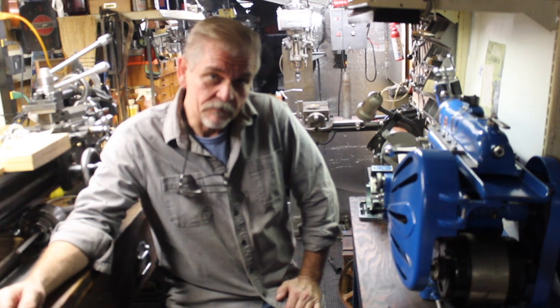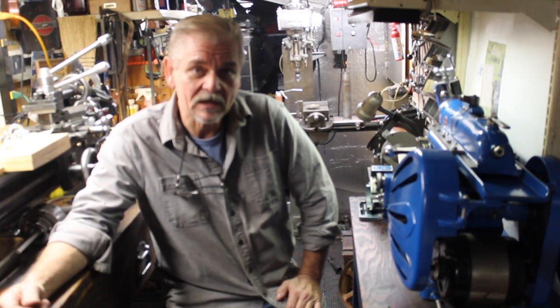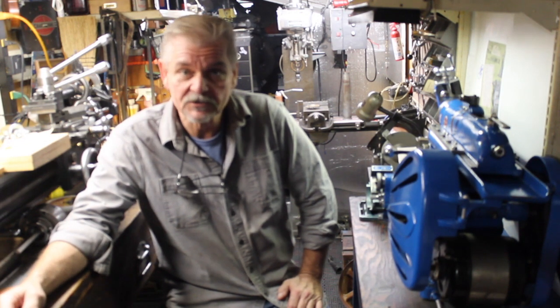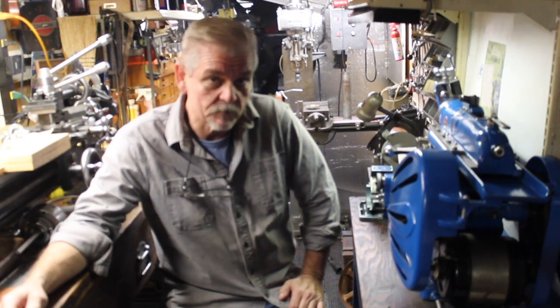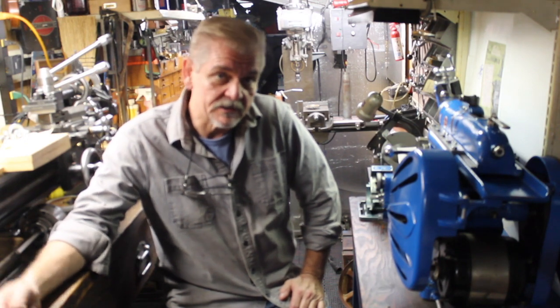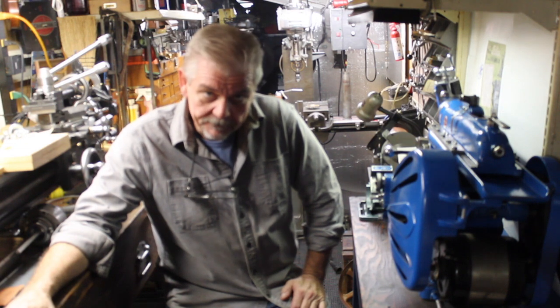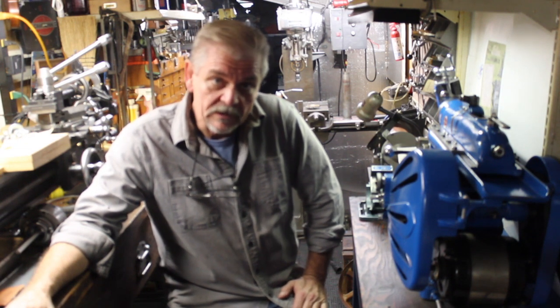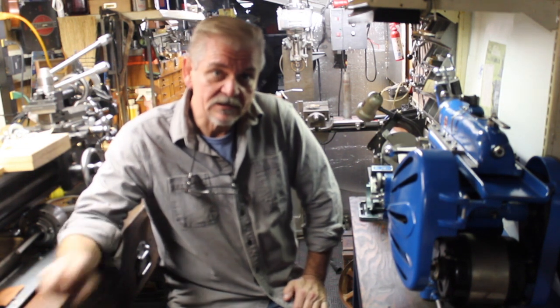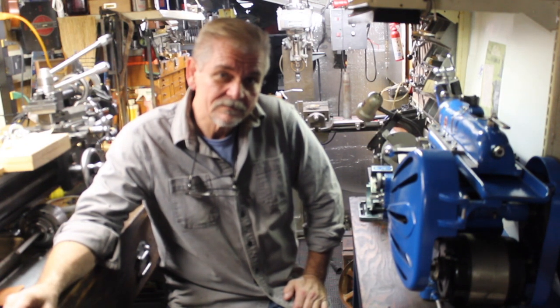This is everything that you missed. I'll take apart the knee, I'll stone it, I'll stone the ways, I'll scrape them with a razor blade before I do that. And you guys kind of get to see what I went through and what I cleaned up and what condition it was in. Okay? So, if you'd like to see that on this Atlas 7-inch Shaper, stay tuned.